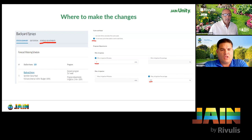Here's where to make the changes. You can do it in grouping, or per-station level. Click on the station you want to change — I recommend doing one or two at a time until you get used to it and see how it reacts. When you go to your station, hit 'schedule adjustments,' and then set your maximum cycle time and minimum soak time. Put 100% for maximum — that gets you the first dynamic way, where you don't irrigate until below trigger level but refill the whole root zone. If you want proactive mode, put '1' for your minimum irrigation minutes. That's all you need — then it shows 'dynamic' on your screen.